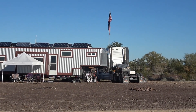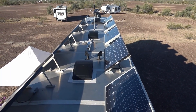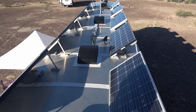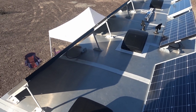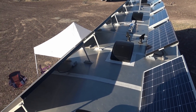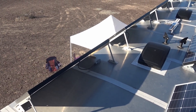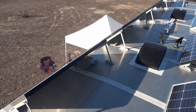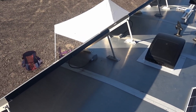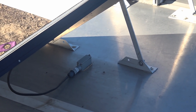He also pulls this thing with a big semi truck. Here we are up on the roof with all the panels. You notice they all have tilt brackets and they're tilted towards the south sun. He's put on 16-gauge aluminum on the roof, and each panel goes down on its own separate fitting going underneath the roof. Instead of having all the wiring up on top taped or secured down, all the wiring goes into the roof and through, so there's less wiring and fewer problems up on the roof. It sure makes it clean.